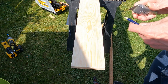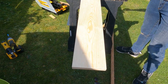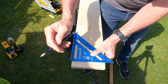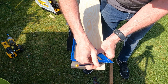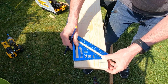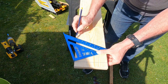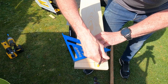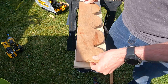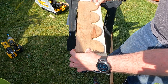Let's start with a really sharp pencil. For this project I'm using inch by six pine, to which I will later add a coat of preservative. My roof is a 22 degree pitch. Using my speed square I set out a line that I could use as a reference to start the design. This plywood template is my design — it was made a few weeks ago from 6mm plywood.